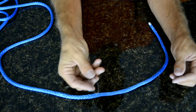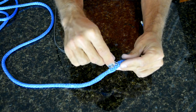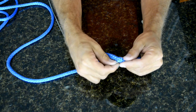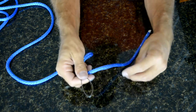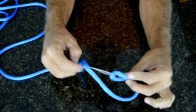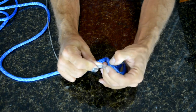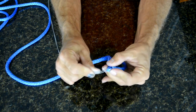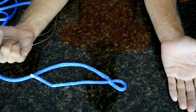Another option is to use your wire with a bend in it. Push your strands through, go through the center, and stick your Amsteel into the wire — it pinches it and pulls it through. Then just massage it until the hole is big enough so it slips through, creating your eye.